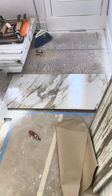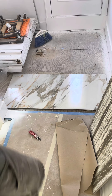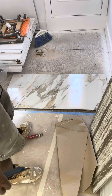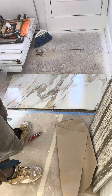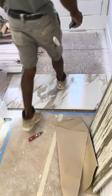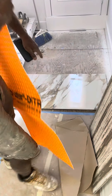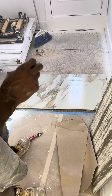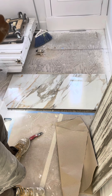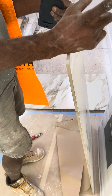Tip of the day: trying to get your tile flush with the hardwood. The hardwood is three quarters inch. Depending on the tile, you're almost always going to use a quarter inch underlayment. Sometimes I use a Schluter — it's a little thinner, about an eighth inch thick. The Durock smallest is a quarter inch thick. With three quarters finish on your hardwood, if you go quarter inch Durock, your tile is about quarter inch plus a quarter inch of thin set — hypothetically, that gets you three quarters.